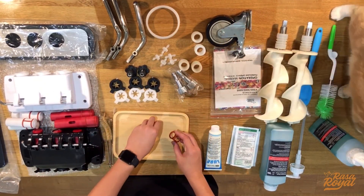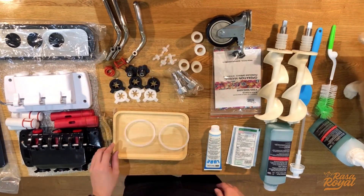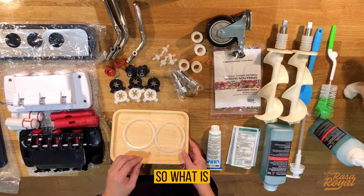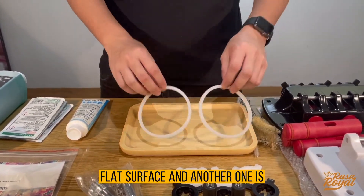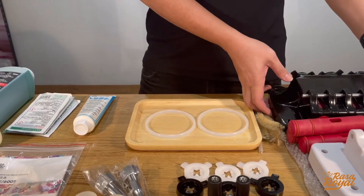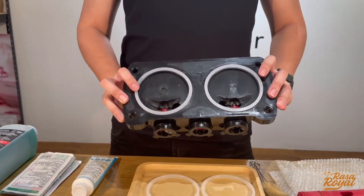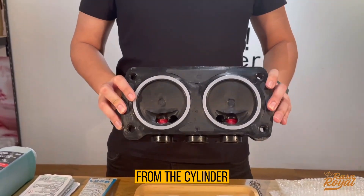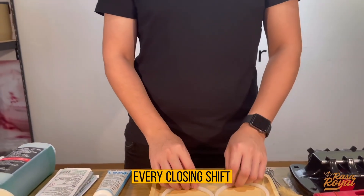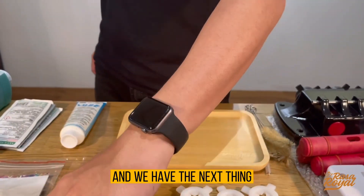The next thing is the discharge o-ring. This comes as a set of two — one with a flat surface and another with a curved surface. It is installed at the back of the discharge door and attaches to the ice cream machine to prevent leaking from the cylinder. You need to clean it up every closing shift and apply lubricant oil.